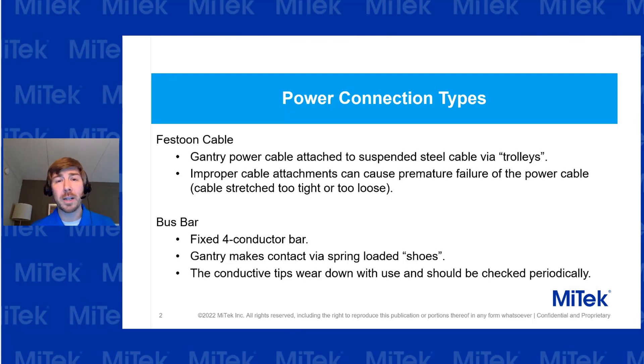For the bus bar, if you don't have good lighting, get a high-powered flashlight and look up there — you're going to be checking the connection for the shoes. Make sure the shoes aren't excessively worn down, and also check the track to make sure it's in good working condition with no breaks. If there are, contact support and ask about the next steps.